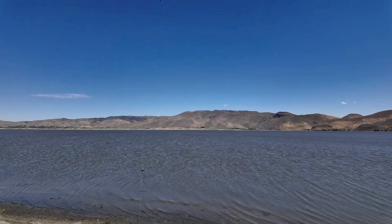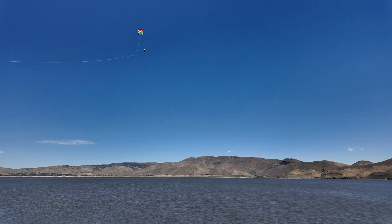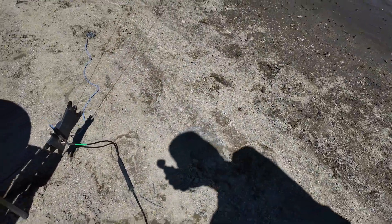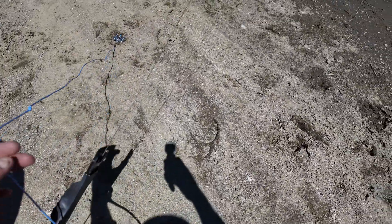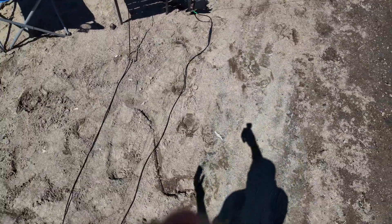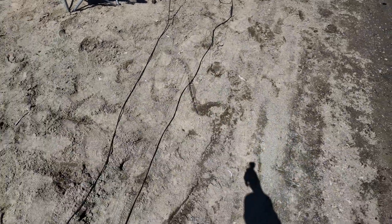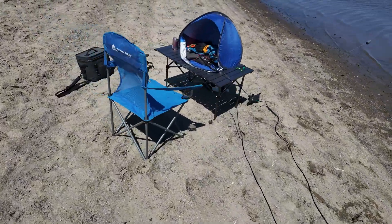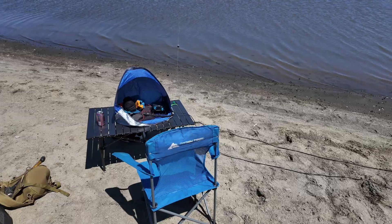When the wind is just right, it's almost a vertical — not quite. Here's my antenna wire down here, and this is my ground clamp, just clamped onto the outside ground of the coax. Then it goes to a spike — a ground rod — that I have down in there. I should have just brought a short coax. I have 50 feet of coax and I kind of just ran it out this way so I don't have it all rolled up causing induction or anything I don't want to introduce into the system.